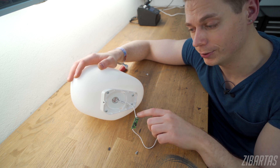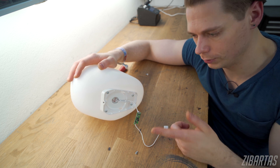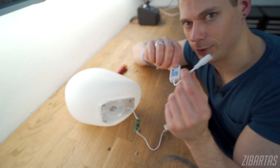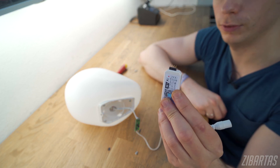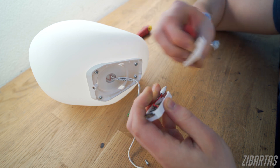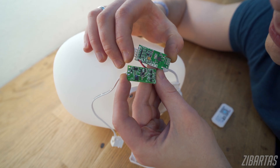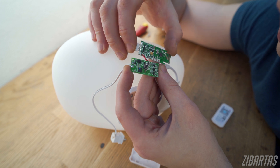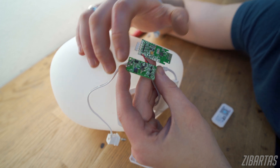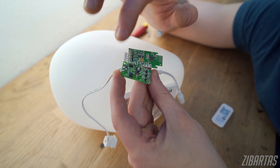There are four wires coming from the controller board to the LEDs because it's RGB — we have one positive and then one each for red, green, and blue. It's pretty much exactly the same thing on the WiFi controller: we have a power connector and then four pins for the different colors. If you can't make out the labels on video, trust me there are positive and negative power supply connections on both boards, and red, green, blue, and positive on both output headers.